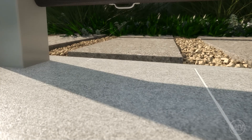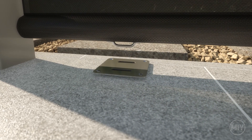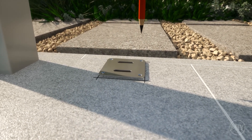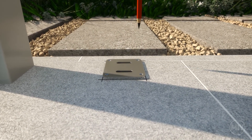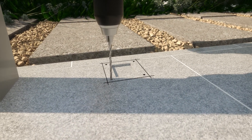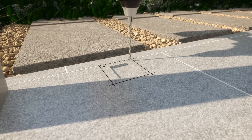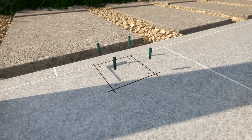Installing a floor plate: wind the blind to the floor with the staples already attached to the bottom rail. Line the floor plate to the staples, making sure they line up parallel to one another, then mark out the floor plate as shown in this video. Drill the fixing points and remove enough material to give the necessary clearance for the floor plate to sit flush with the floor. Fix the floor plate with the correct fixings.